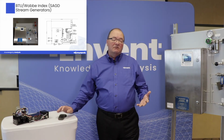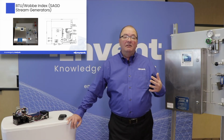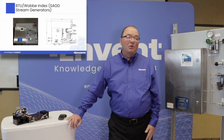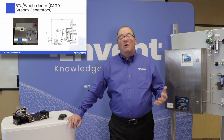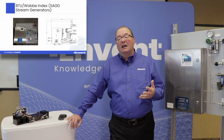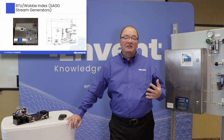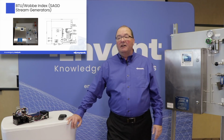Now as far as BTU analysis goes, we're not a cash register. We're not a GC that's going to give you plus or minus 0.25 of BTU. But what we can give you is 10 to 15 BTU analysis as far as accuracy goes, but in a much faster response time. And so in certain applications, that's more than good enough.